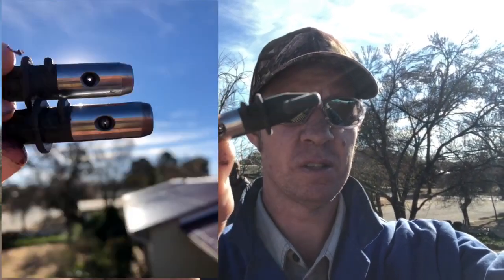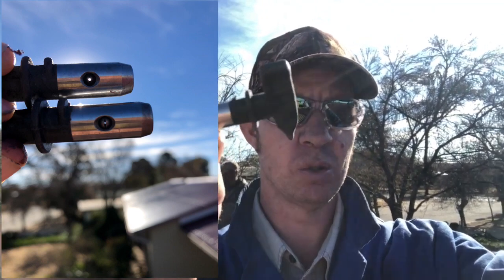I'll take a photo of a new one and this old one side by side, and I'll spray a little bit so that you can actually hear the difference — how you can pick up that the one's blown out. The blown out one also gives you a narrower streak, a much thicker paint coat, and it looks like orange peel. It doesn't look like a nice smooth application like a brand new tip.